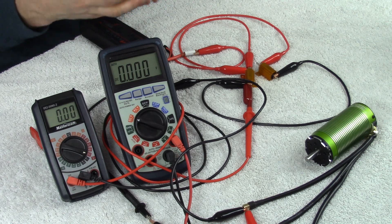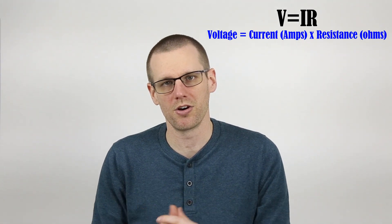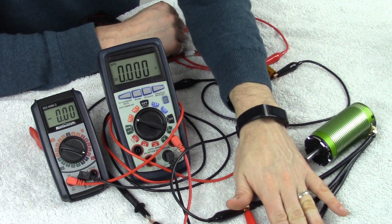The reason we have to set up this complex circuit is because we cannot directly measure internal resistance. The internal resistance is going to be very low for a motor like this, and it's not possible to get an accurate reading with our multimeters. Instead, we use the formula V = IR — voltage equals resistance multiplied by current. We pass a current through the motor windings and measure the voltage drop across them, then use that calculation to determine the internal resistance value.